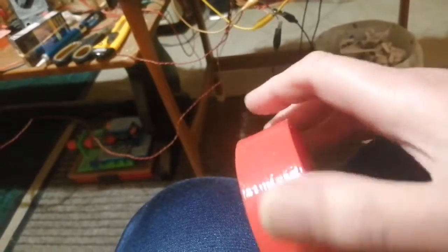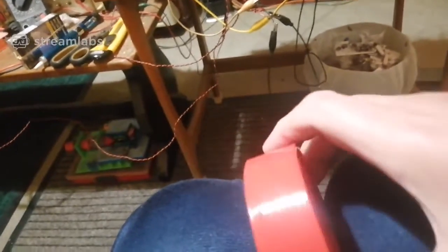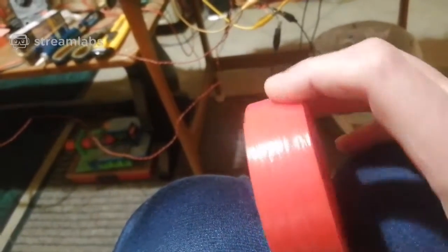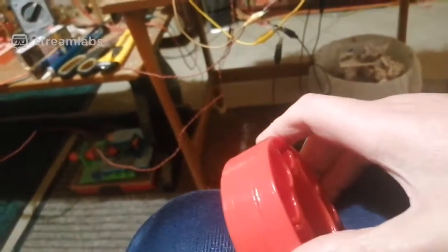The top layer is printed colder, so you get a differential between the top layers and the bottom layers, and they try to separate and they split, and the only way to avoid that is to enclose the whole printer in a chamber to keep the whole thing hot like an oven. Well, not literally like an oven, but just away from drafts and things. Anyway, it's fine. I can use it.